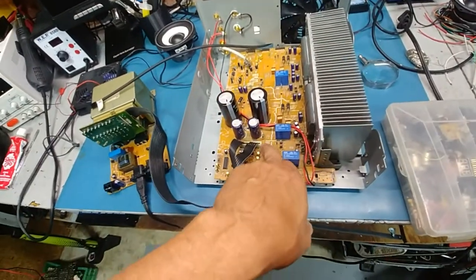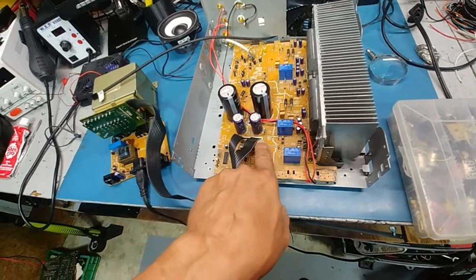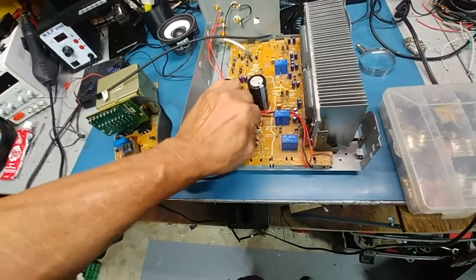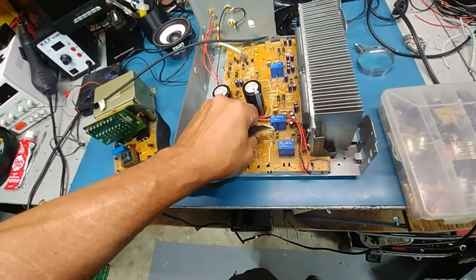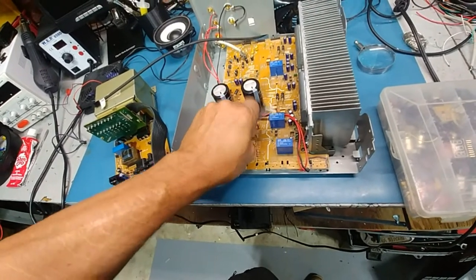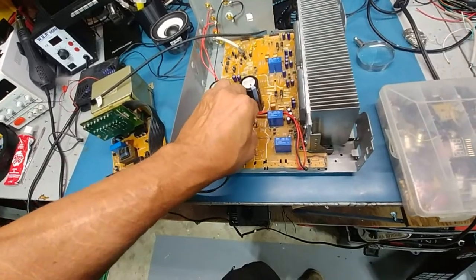What I should have done is taken a marker and just marked it for reference, because you really can't see that white line too well and I was in a hurry — I just plugged it in and didn't really think. And as you can see, because of a stupid design, you can reverse them. So yeah, that's what blew it up; that's why there's no regulators working right now.